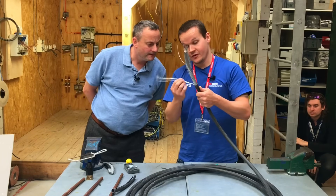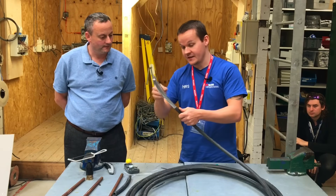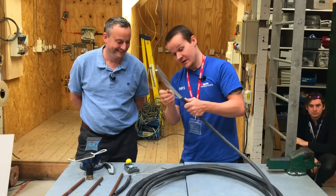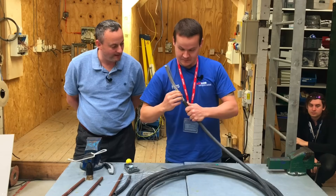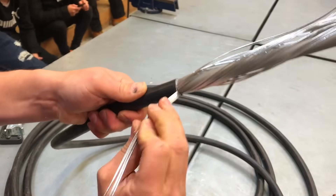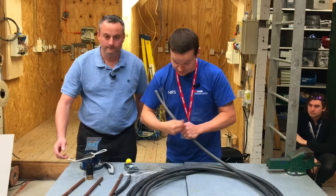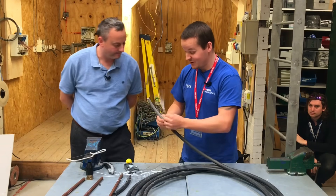The result is a nice equal cut. You can do the armour wires individually but you'll be there all day — do three or four at a time and go in order. Don't grab two from one side and two from the other or you'll get the hook effect. Chris notes that Joe had a go with one previously and got a few hooking bits, but that someone messaged to say after three or four attempts you get the gist. Chris used to use a hacksaw — that's how he was trained — but now he'll jump straight onto the pipe slice.